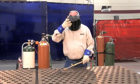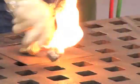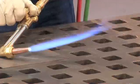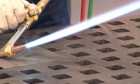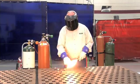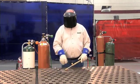The first one is much like you did with acetylene. I'll turn on the fuel valve about a quarter of a turn, ignite the flame, and then adjust it — add the oxygen slowly and adjust it to a neutral flame. I can walk this up to the heavy heat desired. I'll then shut off the oxygen first and the fuel gas last. You'd use this in most situations.